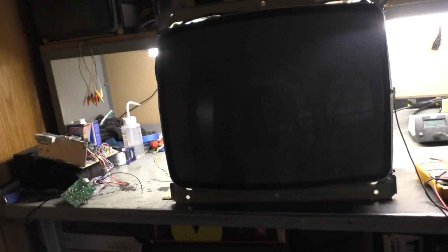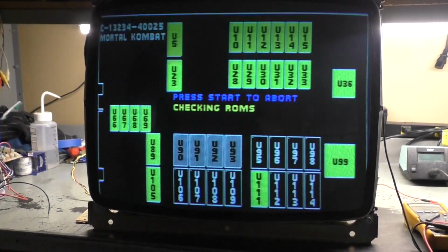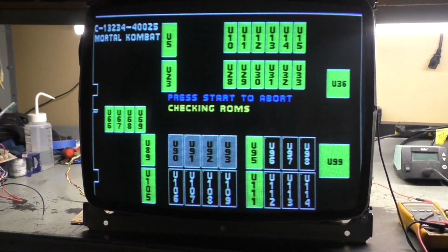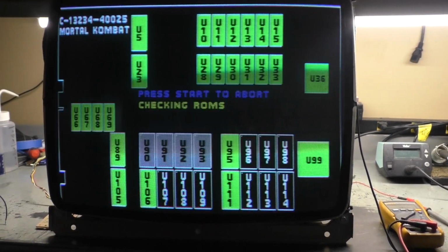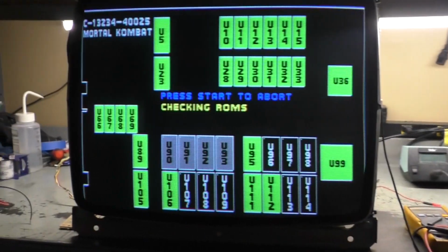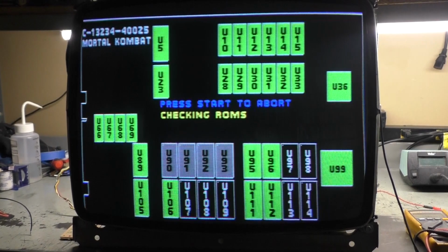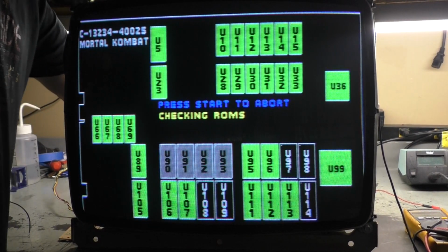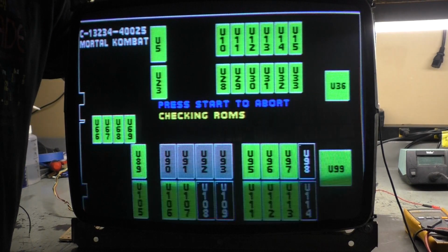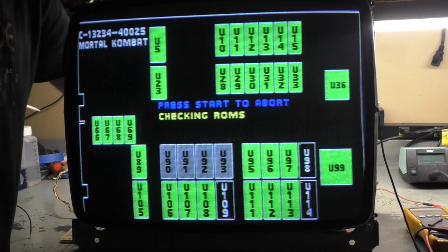And let's put this on the tripod. And you can see we have a nice, perfect square image. There's no linearity problems. Everything is now perfect. Just had to add that cap and that diode and change out that width coil. And of course, we know contrast is too high right now. A little bit too high. Right, oh, that's brightness. Right there is a bit better.